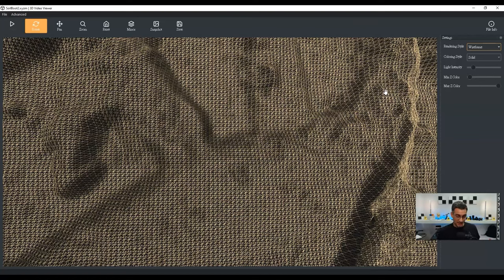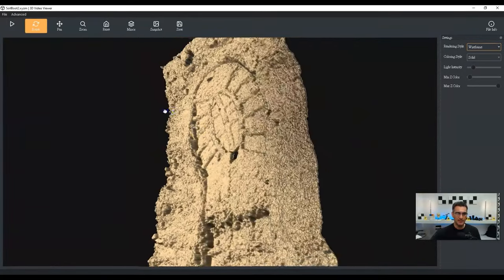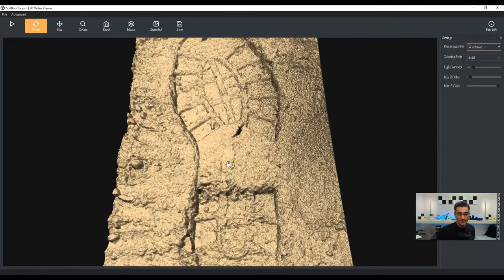The other thing I wanted to address is the accuracy — that depends on the mode, high res versus low res — but you can get up to about 80 microns. There are other factors like the type of surface: very dark surfaces, wet surfaces, shiny objects, or sand with bits of glass that sparkle or reflect can cause artifacts. So it's a bit of a gray area when it comes to accuracy, but this is a prototype and it's doing a pretty good job. There are things here that could be quite useful in forensics when dealing with footprints and shoe impressions. Thanks for watching, and hopefully we'll see you on the next one on Click3D.